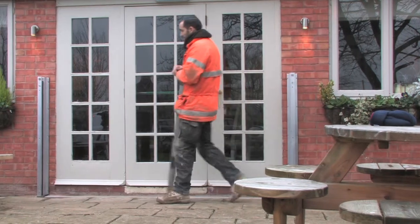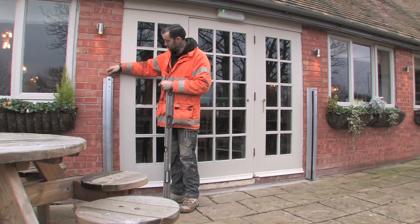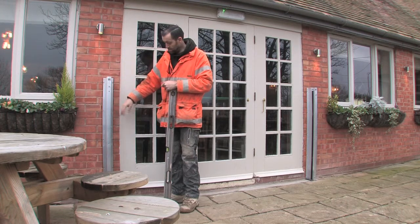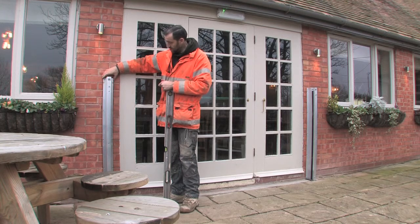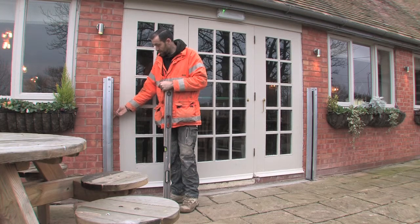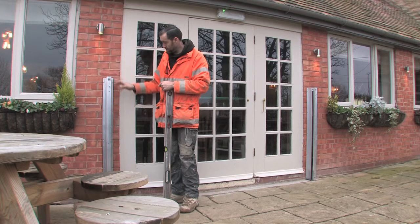With a sealant on this one, you'll find the centre point of the rail. Once you've drilled the screw holes, you know your centre line. In between each screw hole, all the way up from the bottom to the top, you run a sealant behind the rail. Once this is compressed, it pushes the sealant towards the edge, and then we run a bead of sealant to tidy it up on the edge, across the top and down the back side, using a translucent one.